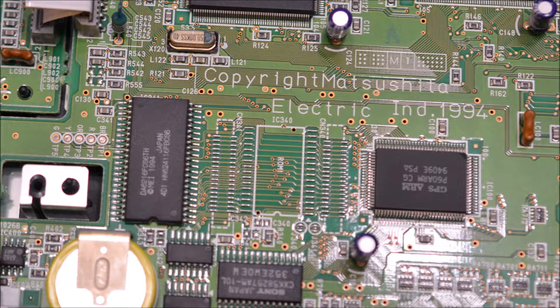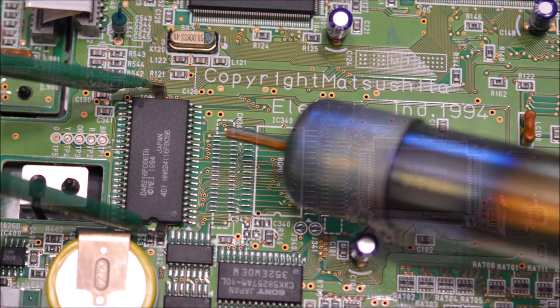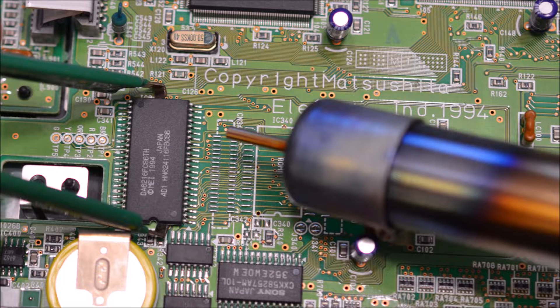When I opened it, I saw something I wasn't prepared for. My Japanese system has just one SOP44 ROM chip. It is common knowledge that Japanese units have two SOP32 chips — one for the BIOS and one for the Kanji fonts. Other regions just have one SOP32 ROM chip and the other space is left free. I thought my chip might be bigger because it could also include the Kanji information, and probably has the second slot left free for arcade applications.